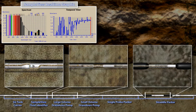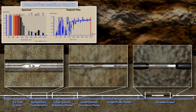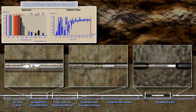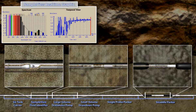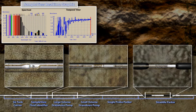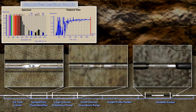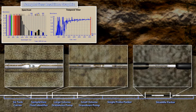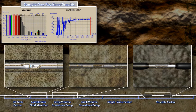We are able to determine how much the light intensity is reduced at each of a series of colors by using wavelength selective detectors. The vertical axis on the spectral plot is optical density, presented on a logarithmic scale: 1 OD is a factor of 10 reduction in light intensity, 2 OD is a factor of 100, and 3 OD is a reduction by a factor of 1000. By monitoring sample view response, samples can be acquired at a minimum contamination level. The channels are closely spaced over the highly absorbing asphaltene region of the spectrum, which is the region most often used to monitor contamination levels. Therefore, in most cases, there will be at least one channel that spans the entire transition from nearly pure filtrate to nearly pure formation fluid. When the optical properties of the fluid being sampled stop changing, the sample has reached a minimum contamination level.